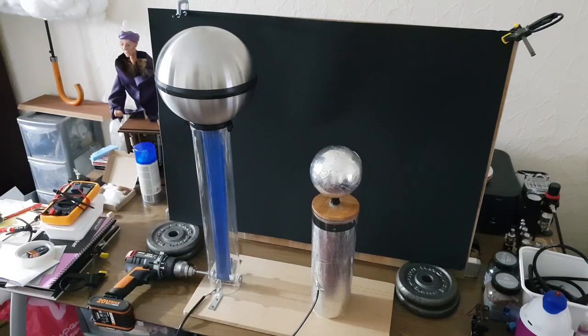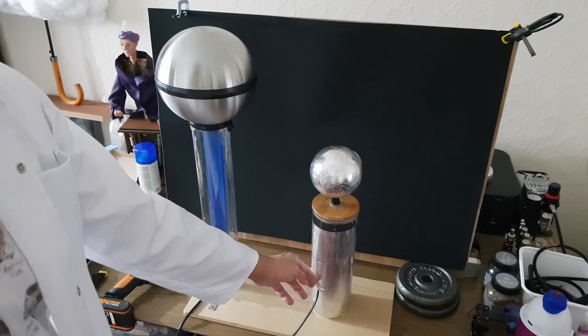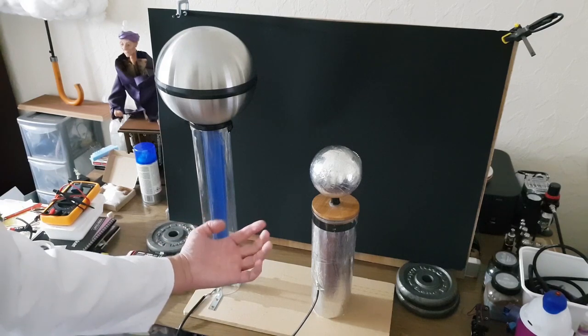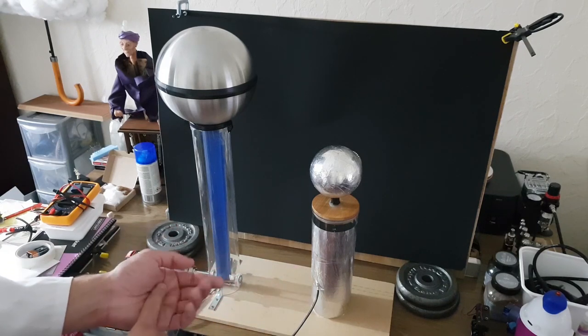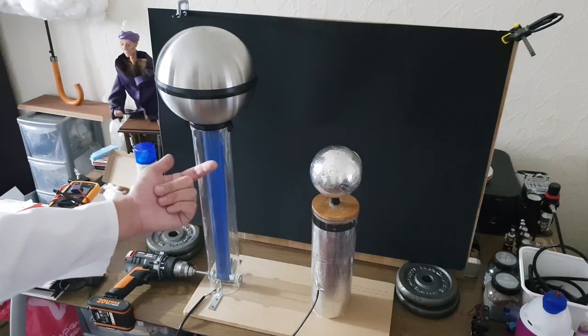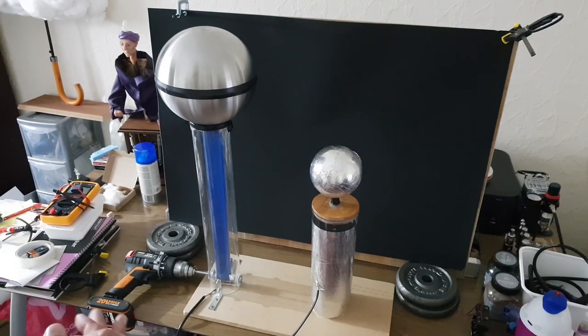To combat the humidity in the meantime, I built this Leyden jar, which is basically a pasta container I bought from Morrisons, wrapped in aluminium foil tape. I connected it to ground using an old electrical wire with only the earth connected. The top is a ball cock from a toilet I bought from B&Q, which I coated with aluminium foil and burnished smooth to avoid losing charge due to the corona effect — I spent about an hour smoothing it out with a burnishing tool.